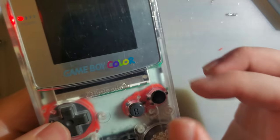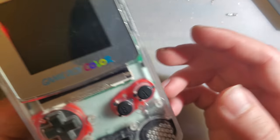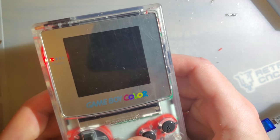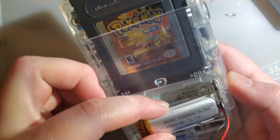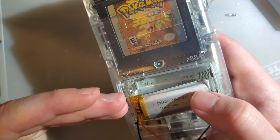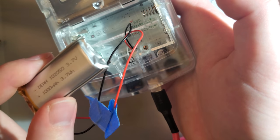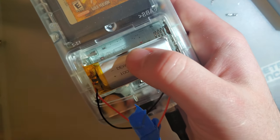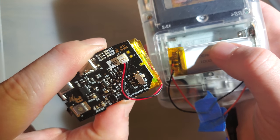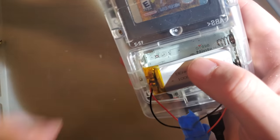The problem with play and charge: if you try and charge this while playing and you leave it on the charger while playing, the battery will never complete its charge cycle — it will be stuck in a perpetual cycle of charge, especially with the TP4056 controller that this charge module uses. That is very unhealthy for the life of the battery. Best case scenario, it just reduces the max capacity. Worst case scenario, it causes your battery to fail. Just don't. If your battery is really low and just about to die, sure, plug it in, get to a safe spot, turn it off — if you can do that within five minutes, you're probably fine. There's just no safe way to do it with the hardware currently implemented. There are methods to work around that, such as installing a load switching circuit, which will switch the load the Game Boy is drawing over to excess current from the charge cable instead of being powered off the battery. But this charge module does not do that — this is only a charge module with no load switching. Other battery mods, like this one from Retro Modding for the Game Boy Advance, do have load switching so you can charge it and play at the same time. That's why there's all this circuitry on the darn thing.